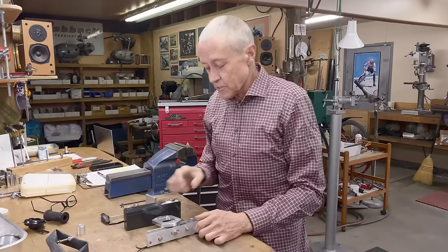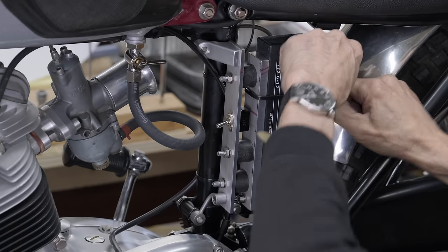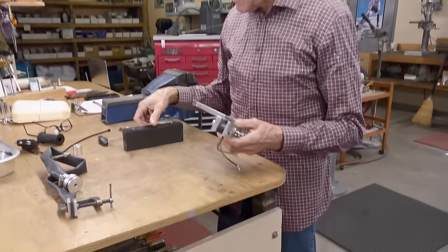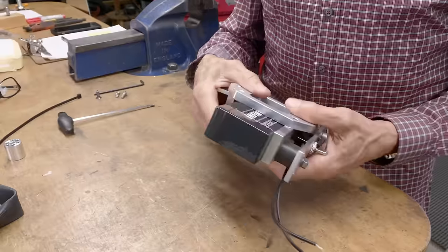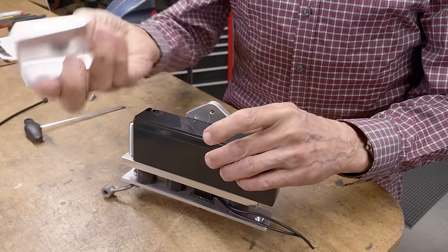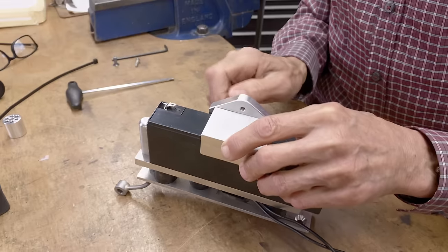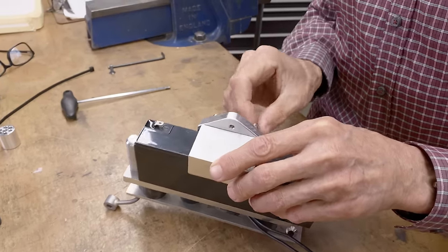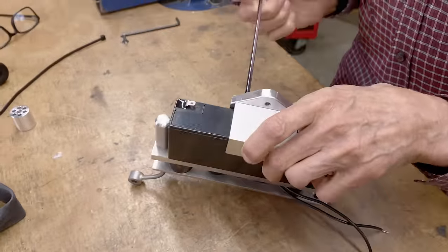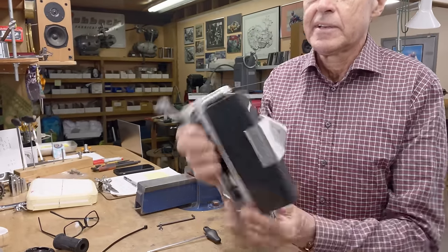I worked on the battery mount because there were a lot of comments about my use of a zip tie — a cable tie. So yesterday I made up a piece of 6061 aluminum, and this is where the battery goes. I'll show you what I've got. That's where the battery fits, and then I made this piece — it's got threaded five-millimeter holes. This holds the battery quite well. I am working on the cub because I want it to be working well, everything just so. See, it doesn't fall — there's nothing on the bottom. Actually, that's the top. It's going to work quite well.